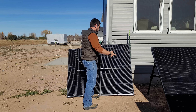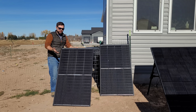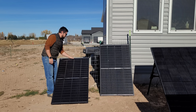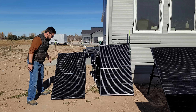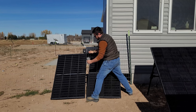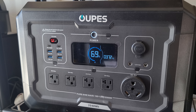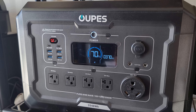Let's see how the two 200-watt CalSun panels do. I really do think the Minuteman solar panel stand is a game changer, since most people end up leaning panels against a fence or house. I'm doing a series connection — positive to negative — and wow, 370 watts right now. These two panels together are almost putting out 100% of their rated output, which is not common. The highest we got was 378 watts — about 94% of rated output for these two CalSun 200-watt bifacial solar panels.